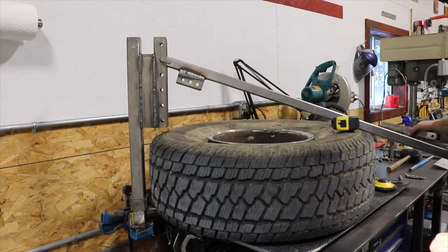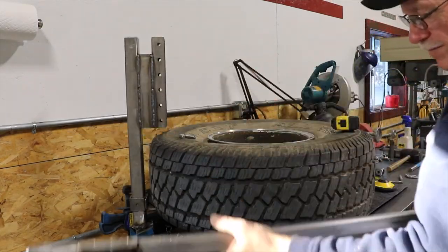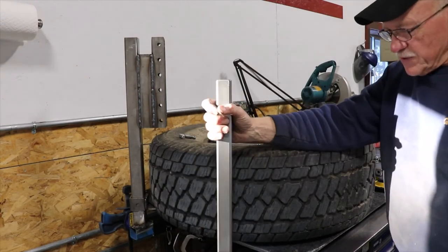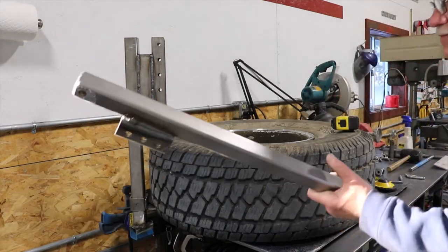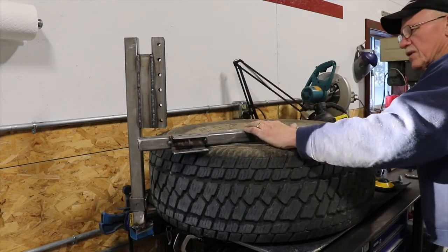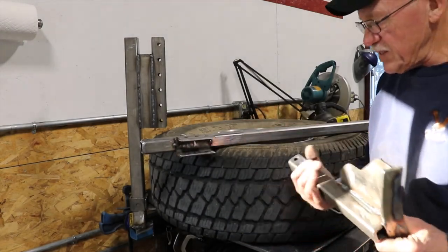This handle here is a full five feet long, and it is one heavy piece. That's five foot from the ground. I was going to use three-sixteenths, but after having bent three-quarter-inch rod, I thought we're not going to bend this guy, so I'll take the weight. This piece here is two-inch square tubing, quarter-inch thick wall. The reason for that is an inch-and-a-half tube will just slide right in there after you do a little finessing with your grinder to get it to fit right.